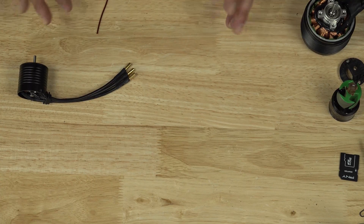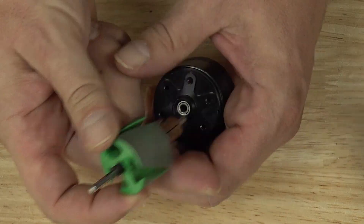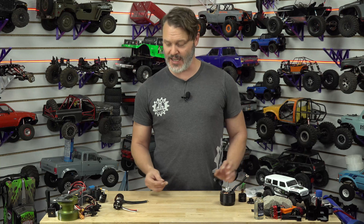I hope these illustrations of real-world materials helped you out a little bit. I think it's a lot more obvious when we point to a brushed motor and show you the parts, because the back iron obviously is not wound so it's a little easier to see — back iron on the inside right there, and back iron on the outside right there. Pretty self-evident. So, great questions. I like that on a video where I was talking about back iron, y'all said, yeah, but what's the back iron? Good question. If you have any more questions about anything in life, leave your comments down below. Thanks for tuning in. Have a great day.